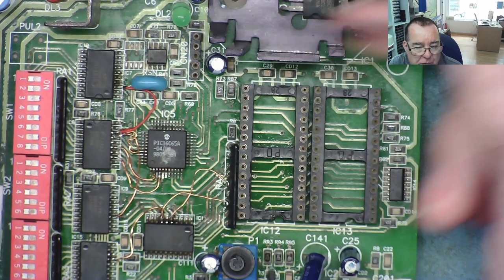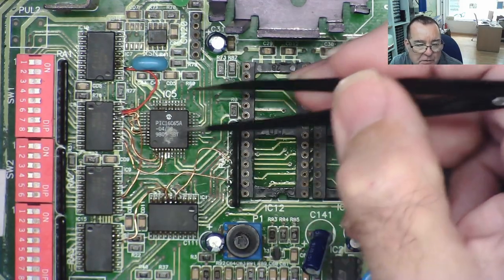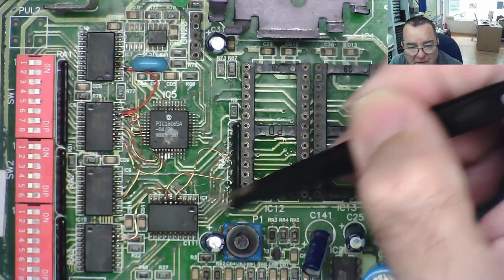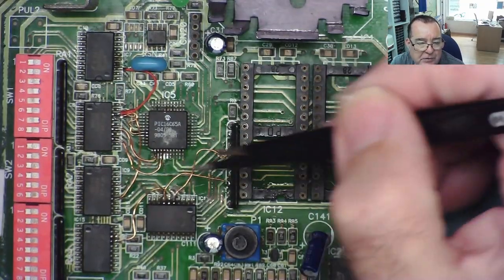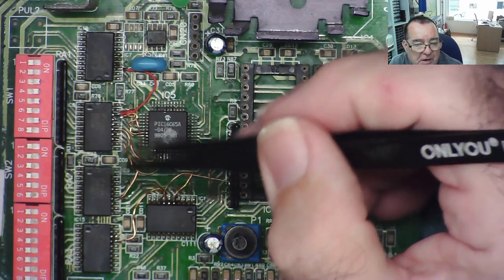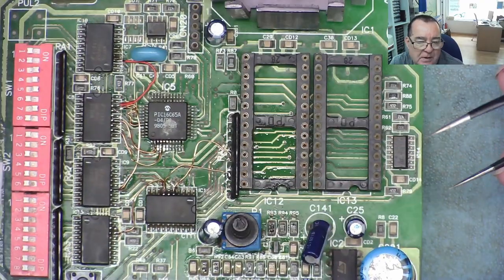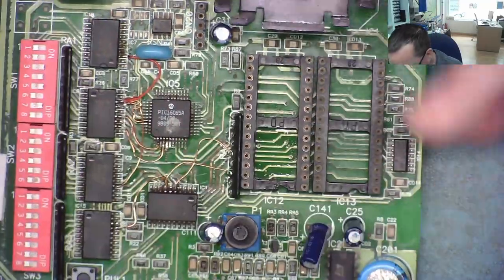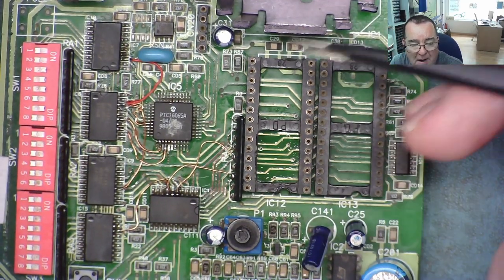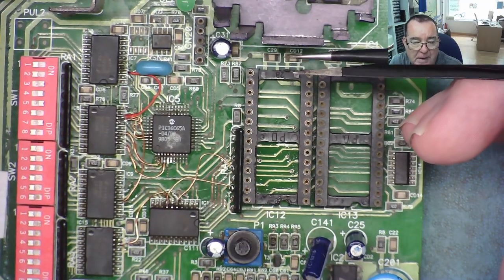If it turns out I've got another board that I can't fix for a reason, such as a faulty processor, and this one is good, what I may well do in the end is take the parts off here and put them onto the other PCB if the PCB is good, because I suspect some of these other tracks which are slightly damaged, they're okay now, but they might not stay okay. So if it turns out that I have another one, I can fix it by changing the processor, I will take the one off this to fix that one. I think that's probably the most reliable way to get the maximum number of boards. But let's see if we can get 5 out of 5. We'll know a lot better once we know how many good EEPROMs we've got, and then we can figure out if we need to, can we actually copy the good one and make some more good ones.